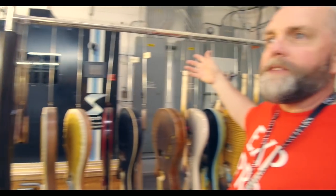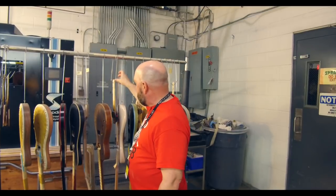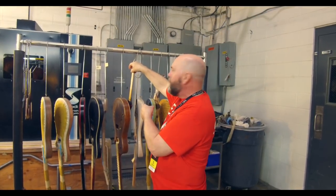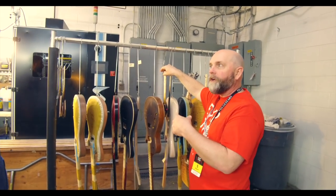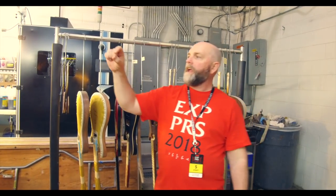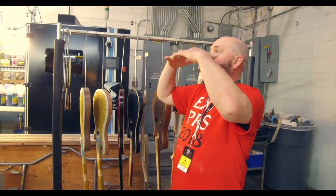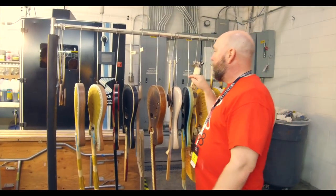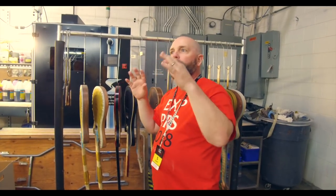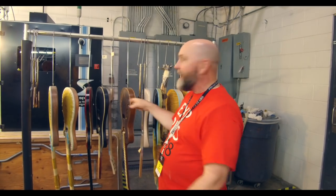So some of our private stocks, if you see them out in the world, some of them have very pretty flame maple back plates and things like that. So here are examples of some plates being made. These are rosewood. However, anytime we put a rosewood or a wooden maple plate on the guitar, it isn't a standard thickness. All of the back plates that are wood in our guitars are typically thicker. The reason is you can't have a super thin piece of, say, figured maple that's been stained. It will eventually start to warp because it's too thin. So when they're specking out a private stock, they have to actually ask the customer, do you want wooden back plates stained or rosewood or whatever, or do you want the normal? Because they have to make sure that if they're going to use wood, that they recess the back plate holes, cavities deeper.